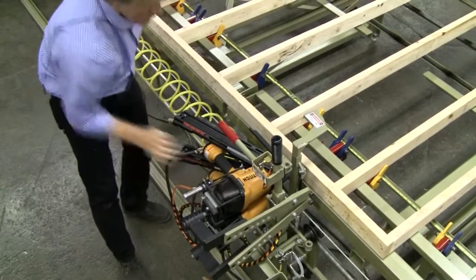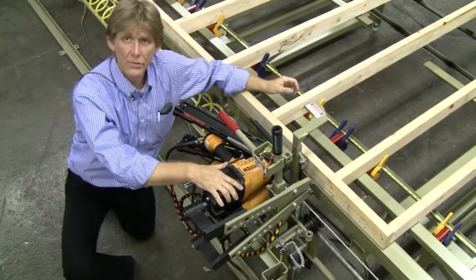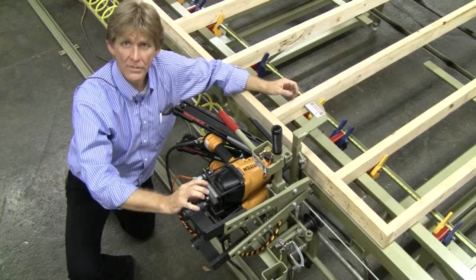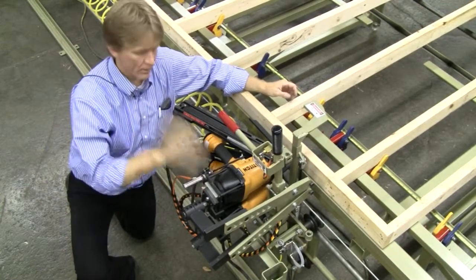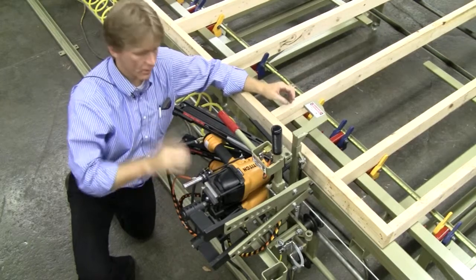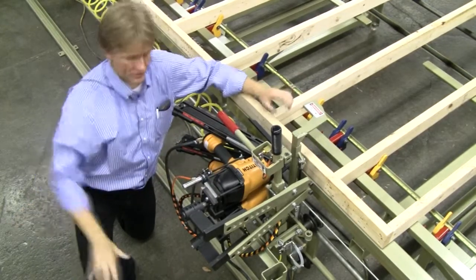If you're going to buy manual dollies from us, they come in a set of two. Ideally, what you want to do is have a couple of extra guns that are already pre-mounted in advance, off on a shelf where the maintenance guys have them. Something goes wrong — it breaks, it wears out, a seal blows — you slam another one in and you don't have the downtime. The maintenance guys can go fix it at their leisure.